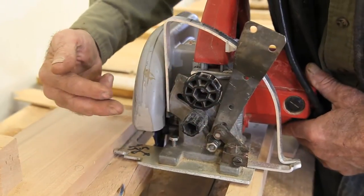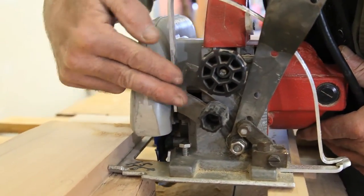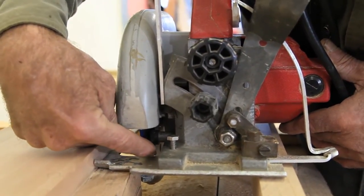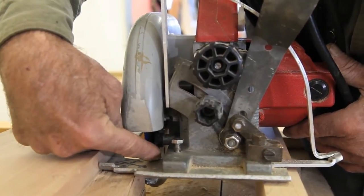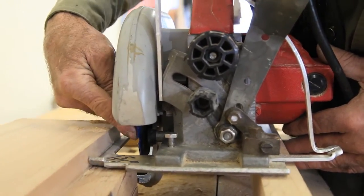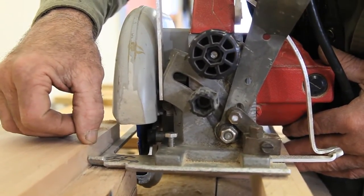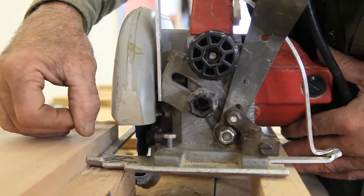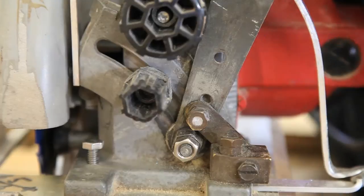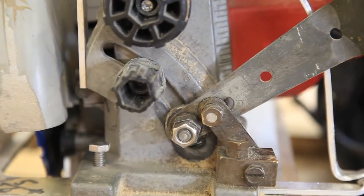This particular saw has what they call a trunnion on it, and this trunnion guides the saw as it changes bevel. There's a pivot point exactly above the deck, so that as it changes bevel, it does not change the distance between the blade and the edge of the table. On any bevel, this particular saw cuts 1 5/16 away from the edge of the table. So this is the mechanism that tilts the saw as we saw along the line right here.